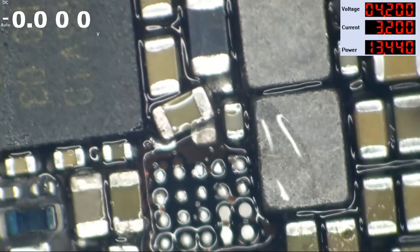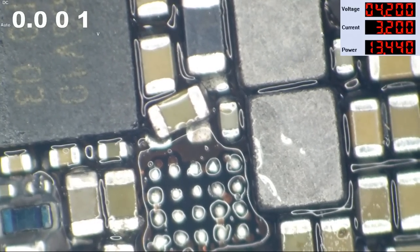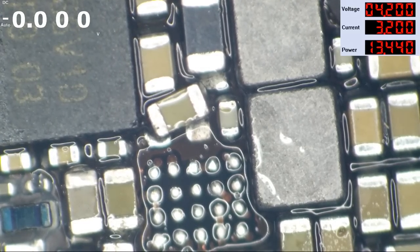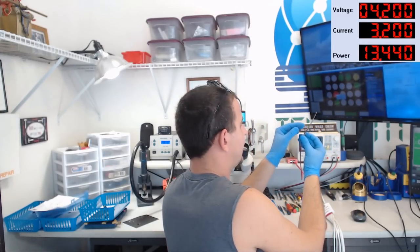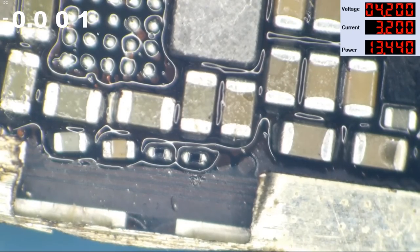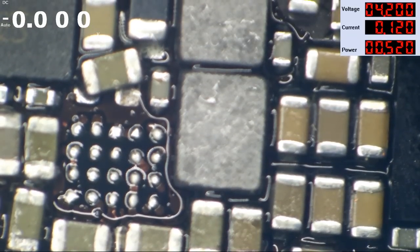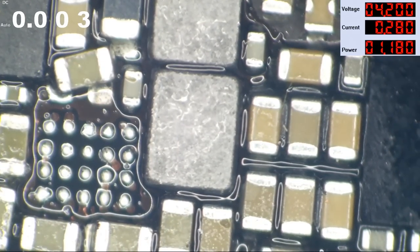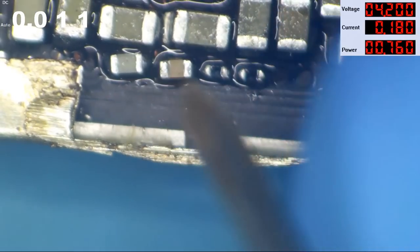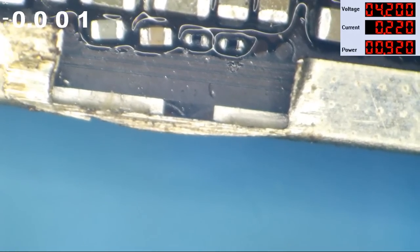Let's use Rossman amounts of flux — that's better. With the board cleaned up and ready to have a new IC placed, let's cool the board off, also inspecting to make sure we don't have any domes forming on top of the CPU. Now with the board cooled off, I'm going to turn the supply on and prompt it to boot: one, two, three, boot — 100 milliamps, 140, 130. This thing is booting! We got 280 milliamps. Now that we've removed our chestnut IC, checking for voltage on our I2C clock line, we are getting 1.8 volts.